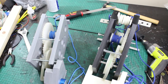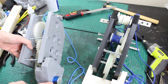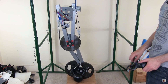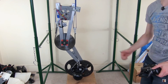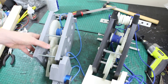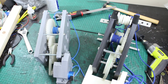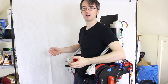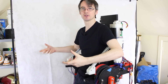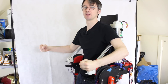I'd really like to reuse some of the gearboxes I made for the exosuit Mark I, which operated the legs. These had brushless inrunners that go really fast, reduced with gears, and then a pulley pulling paracord which in turn pulled blocks and tackles to gear it down further — and those could lift quite a lot of load. I think what I'd quite like is to make it compliant so I can move the arms without the motors running, and then activate something — either with triggers or other controls — that pulls those tendons and gives me some force to move something with the motors.